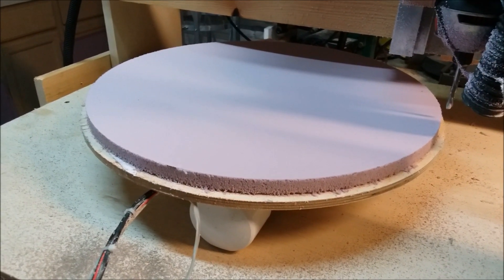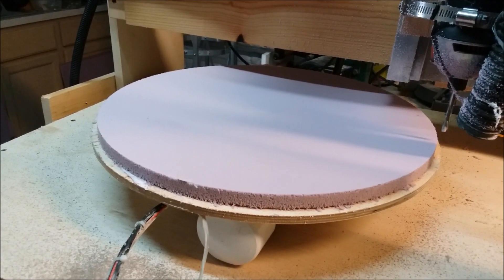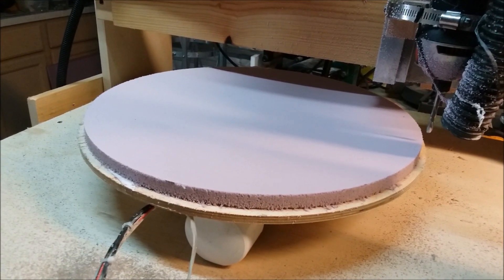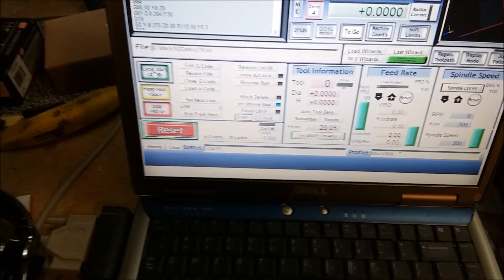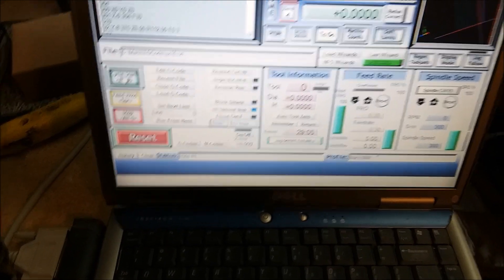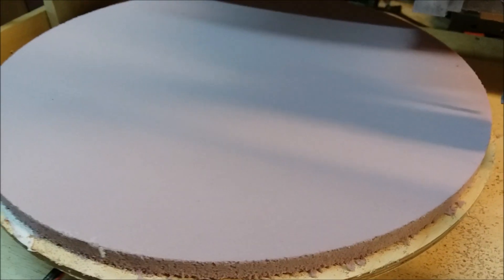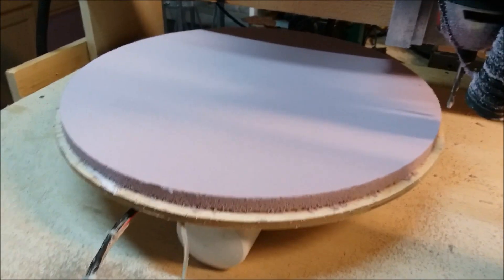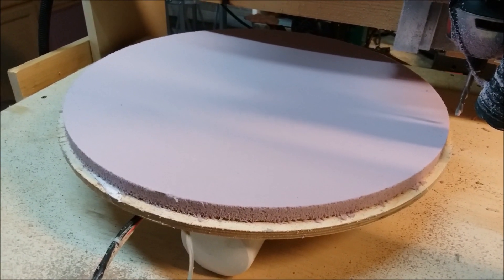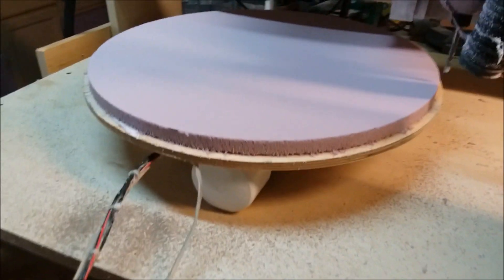Well, that worked out very well. My new rotary table is allowing me to make molds for making slumping molds much quicker and easier. That took 29 minutes and 5 seconds, and it could probably go faster. I'm being really conservative to try and get a nice surface finish on there, which I think I've got. I don't think I can get much smoother than that — I think I'm up against the actual grain of the foam.